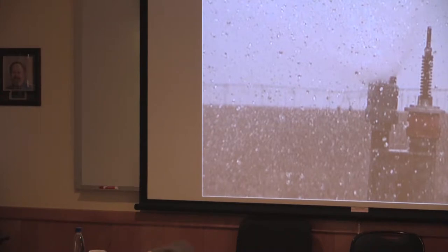Have you ever seen one drown? This was confusing. I had to put a brand new drip system in down at Idaloo, and every time the system would change valves, that air relief would start blowing water. I'm watering three times a day, three valves at a time, 5 minutes apart, so the valves are changing nine times a day, and this air relief is doing this, making a mess. And what it is, it's called drowning.